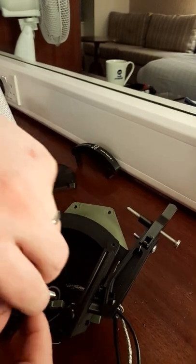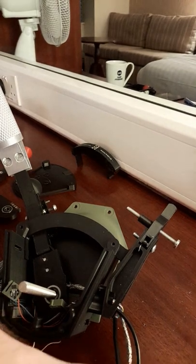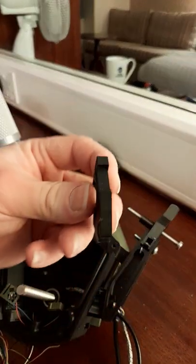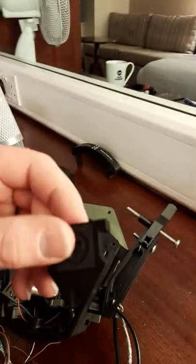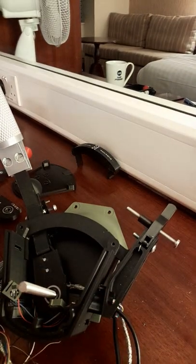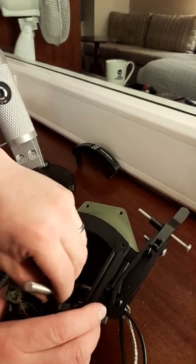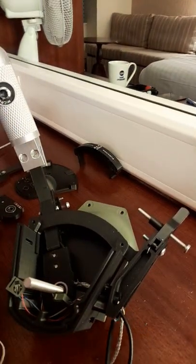A little bit of a fiddle. Make sure we take that washer off. I do want to keep these in order because they are stacked. They've got little inserts for the clips to hold it. I'll put that one on top of that one, so that one's the bottom. So get the next little clip off. You just build this all as a stack. Now the throttle, I've got to take the wires out for the throttle, hold on.